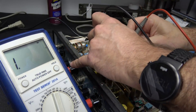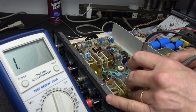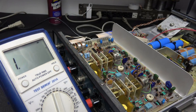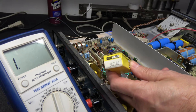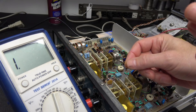That doesn't look right on channel one's Q102. Let's kill the power, go to diode check mode, and compare both transistors. On the good channel: base-emitter shows 0.7, and base-collector looks the same. On the suspect channel: the base-emitter reads high, but the base-collector side is okay. So we clearly have a bad transistor. It's one of those Heathkit part numbers — 417292 — which according to the schematic is actually a 2N5771. I don't have any of those but I do have an ECG 106, which is a direct cross according to NTE's website.